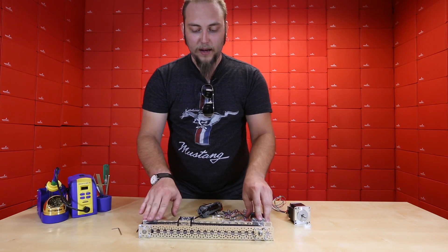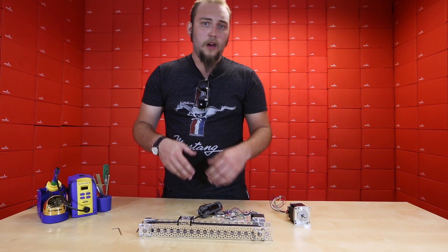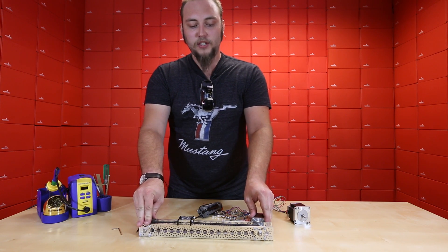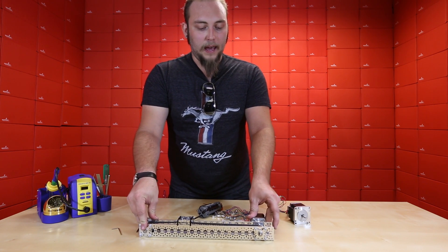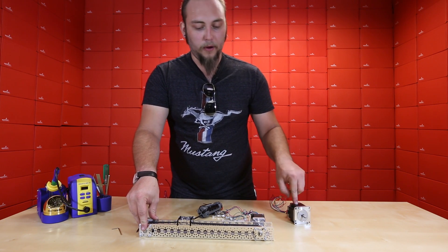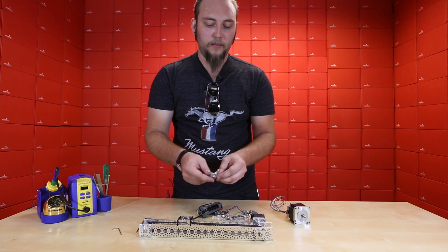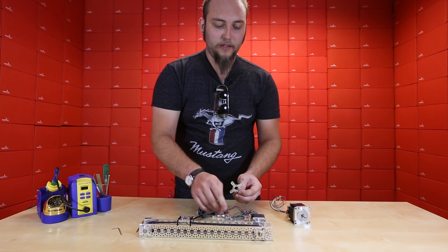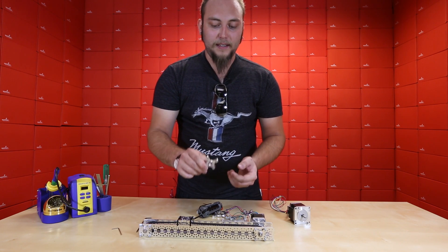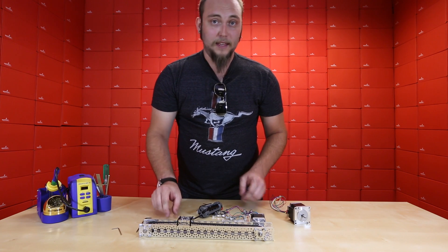This channel slider can now be positioned repeatably and accurately by the stepper motor. This is an excellent way to connect stepper motors if you want to do something like a 3D printer, a chart recorder, or a small CNC mill — applications where you need precision and repeatability. These brackets make it very easy to attach stepper motors to your channels. A lot of the time you'll need some standoffs between the mount and the channel to have enough space for everything on your drive shaft, but these are excellent pieces of machining and I recommend them for any stepper motor project.